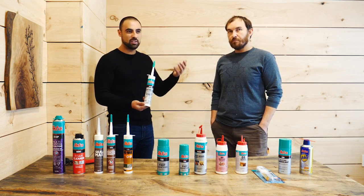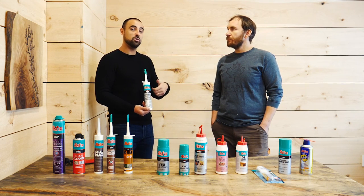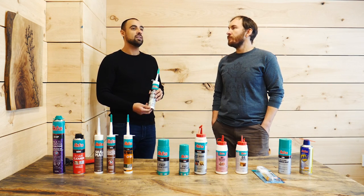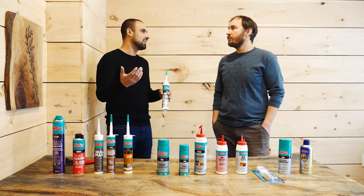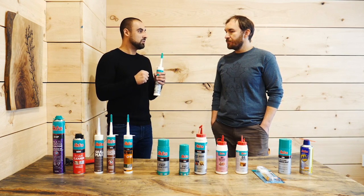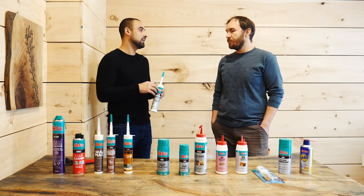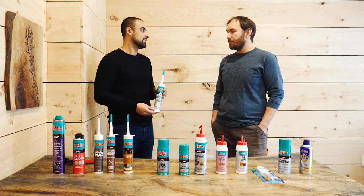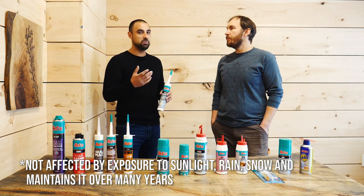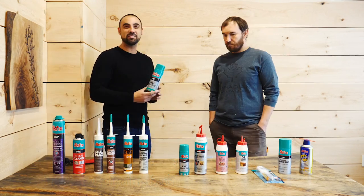When you're building the dams, the colors obviously don't really matter, but when it comes to exterior use, if you're using this for windows, doors, flashing, anything like that. Yeah, okay. This stuff here, the elongation is up to 350%, and it'll keep 50% flexibility down to minus 60 degrees Celsius. Okay, wow. So this is something that would pretty much outlast the windows.